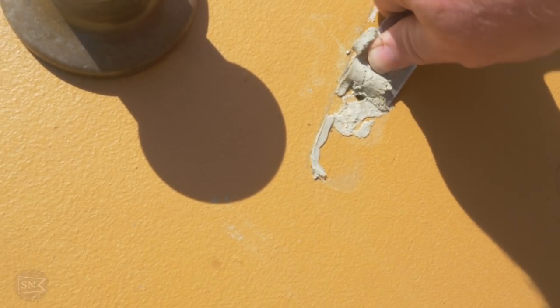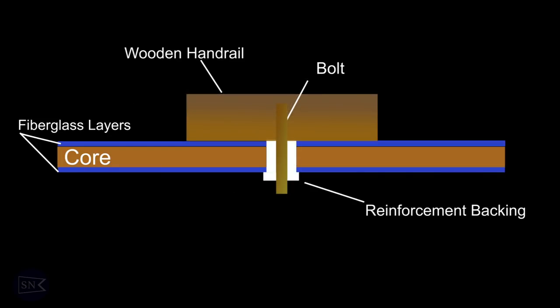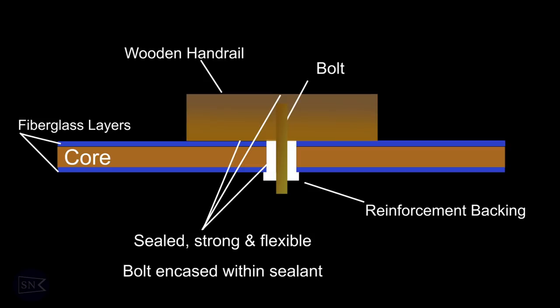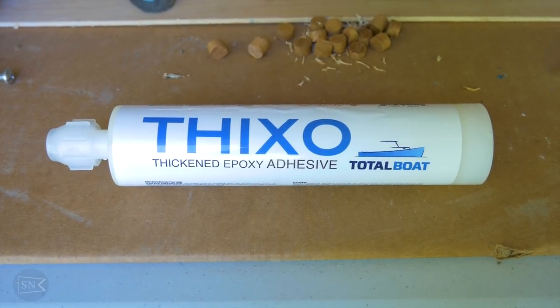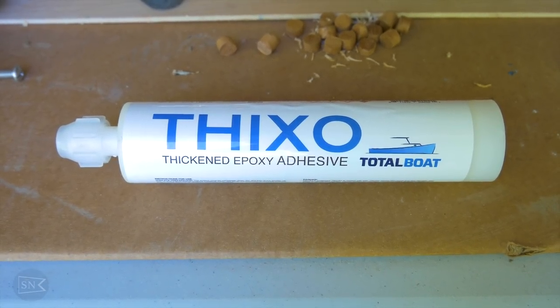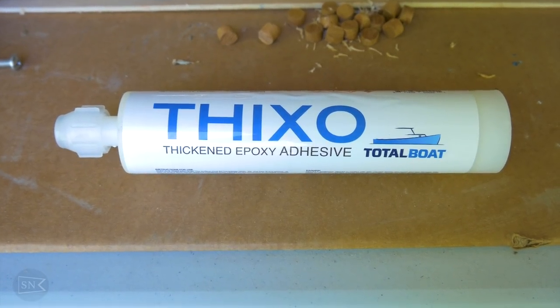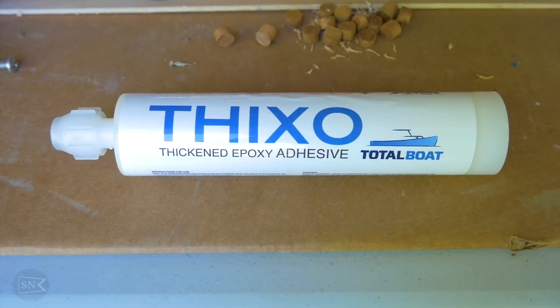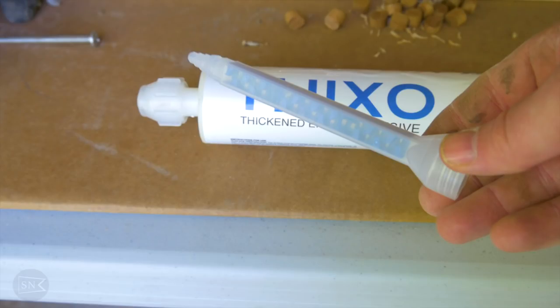With this situation being a little unique, I didn't just want a close-fitting hole with the bolt going through epoxy-lined holes. I wanted the bolt to be integrated and encased in the bedding material, so the bolts went in while the bedding and adhesive compound was still wet and cured around it to make a still somewhat flexible yet very watertight mount. After doing some research and seeing master shipwright Dan Shea using this product on joints and seams for boat building projects, I decided to use Total Boat's Thixo Adhesive Sealant. It's a pre-measured thickened epoxy that retains some flexibility after it cures. Be aware this is a two-to-one epoxy requiring two chambers in the tube, so you need a caulk gun that allows for off-center cartridges. The tube gives about half of its total volume in perfectly mixed epoxy, using special tips that mix the two parts as it exits.